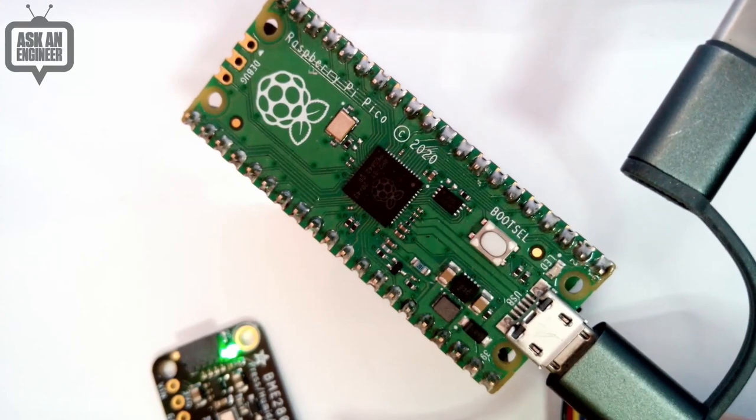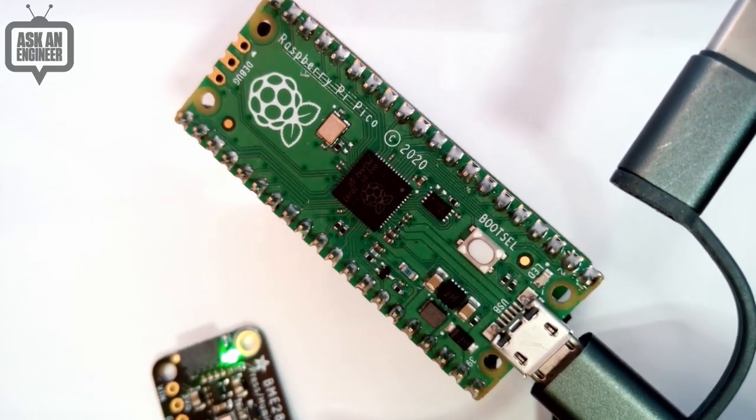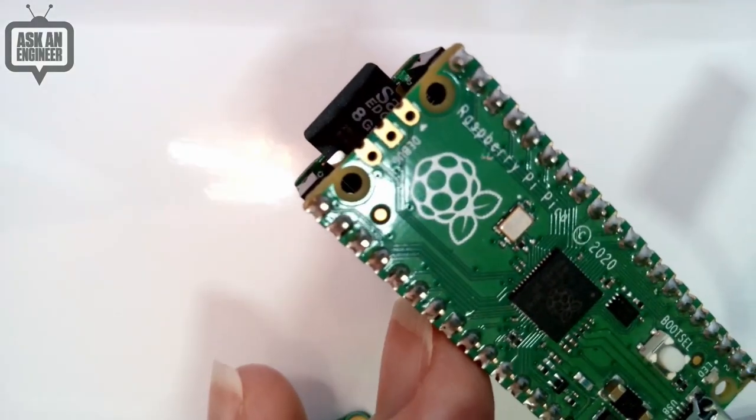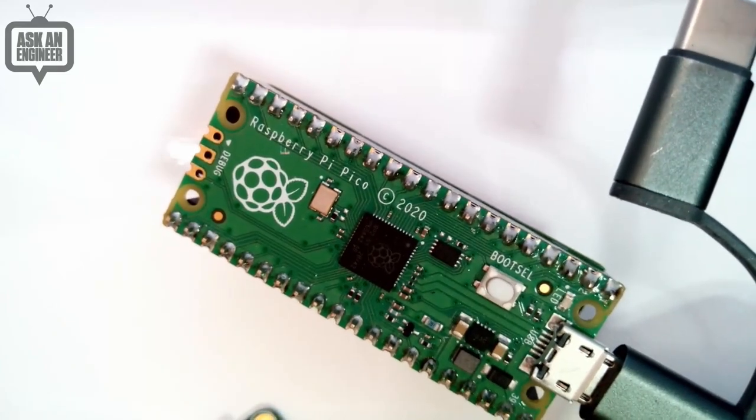Okay. So this is a Raspberry Pi Pico, and I've got it wired up over the STEMMA QT to a BME280. And then you'll notice that this LED flashes every 5 seconds. I just wrote a little bit of CircuitPython code, or maybe it was Arduino code, I don't remember, that will read the temperature, humidity, and pressure off of the BME280 through the plug and play connector, and then log it to the SD card, and then flush that data to the SD card. We'll publish all that data as well.